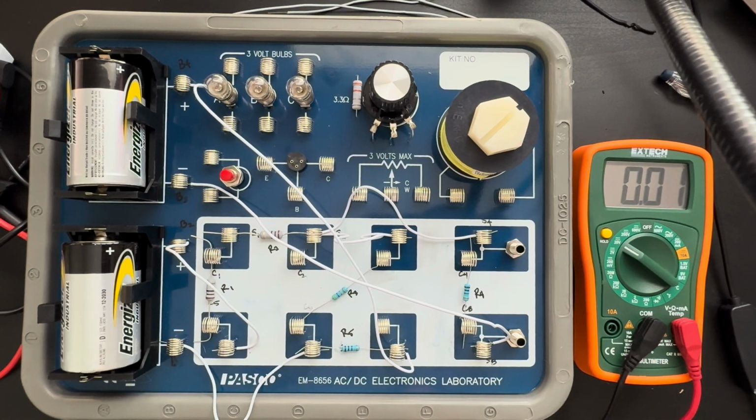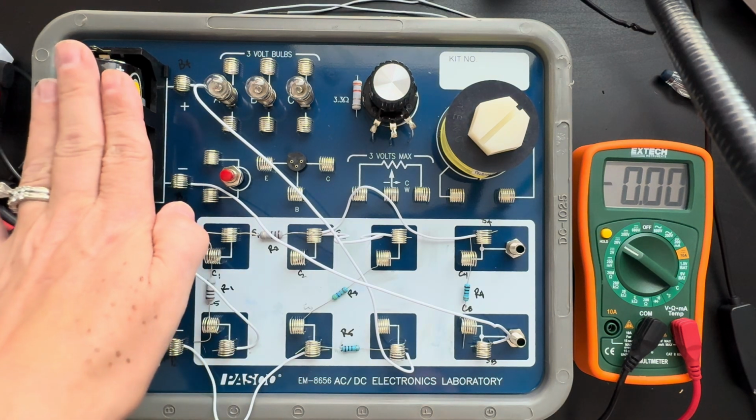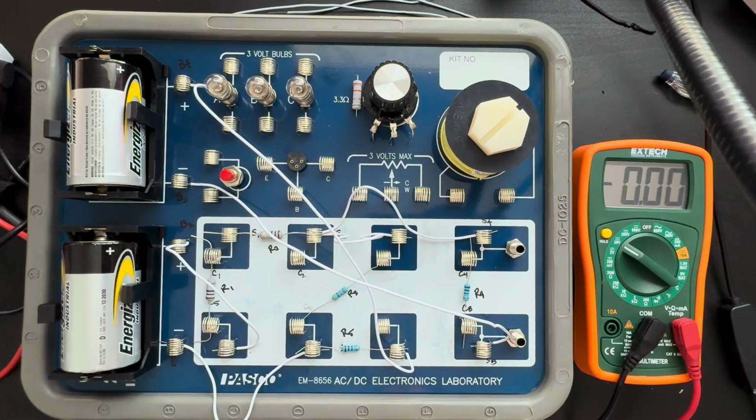All right, so this is Kirchhoff's rules, lab number 4. We've already set the circuit up, and so now I want to take all of my voltages. I've already gotten V1 and V2, and let's remember V1's on the bottom and V2's on the top. Now I need to measure I1, I2, I3, and all of my voltages across my resistors. We're going to start with the measured voltages across the resistors, and then I will enter it into my spreadsheet.